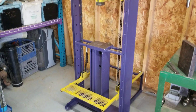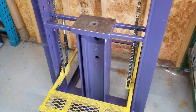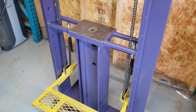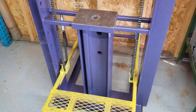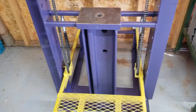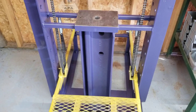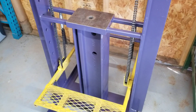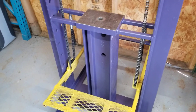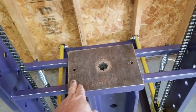As with most hammers, the anvil is pretty much the entire thing. You get a good anvil and most of the work becomes easy after that. This is two 30-inch pieces of 136 rail. As I understand it - I could have the nomenclature wrong - 136 rail is 136 pounds per yard, and doing the math, two pieces 30 inches long should be about 217 pounds roughly.